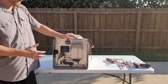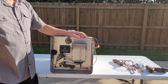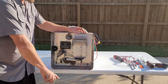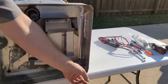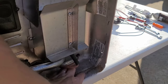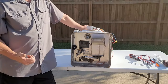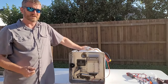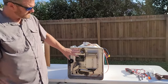This is a 12-gallon model, so it's physically a little bit larger and holds 12 gallons of water. There's also a 10-gallon model and a 6-gallon model. The best way to find out what you have is to look at the label, which will always be in the bottom right-hand corner. The model number here is SW12DE, which tells me it's 12 gallons, it's a Suburban, and it has DSI — direct spark ignition — meaning it has both gas and electric features.